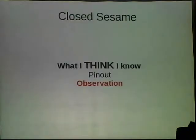Once you think you have a better understanding of what's going on, you don't necessarily, because we were wrong about some of this stuff, you can start monitoring traffic on the board. What we used for that was another tool called a Bus Pirate. Does everybody know what a Bus Pirate is? Some people? It's a little guy like this, also sold at Seeed, SparkFun, everywhere. The nice thing about it is you plug it into your computer, you tell it to expect SPI, UART, I2C, single wire, Dallas, all these different protocols, and it'll decode them for you on your screen and show you the binary representation of what's being sent across the wire.